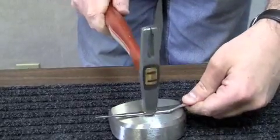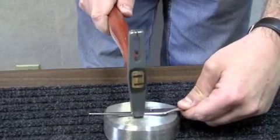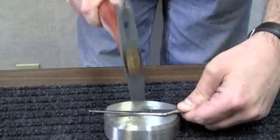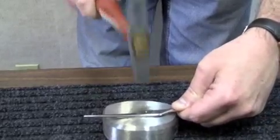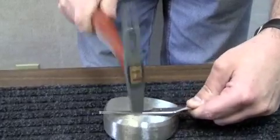The key with hammering set into a scissor is making sure that as you come over your curved block, you're striking in the sweet spot. You can hear here I'm hitting the sweet spot, but if I turn up you hear the difference in how it strikes. So you want to hit that sweet spot. You want to start behind where the problem is and work your way across.